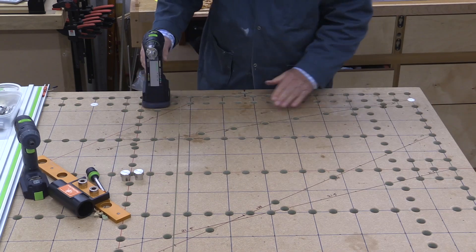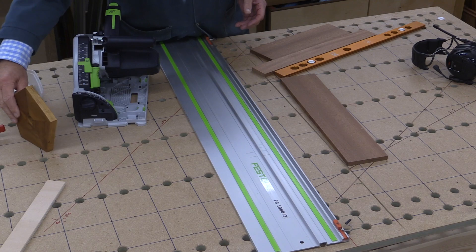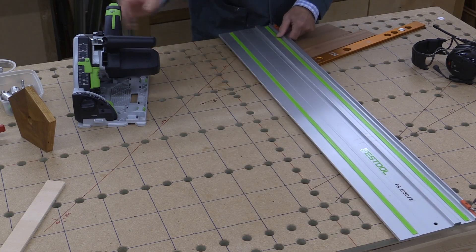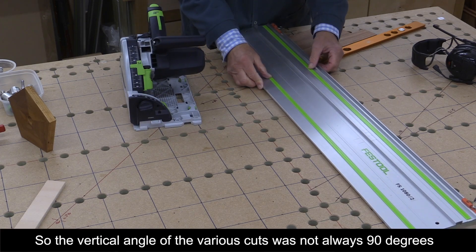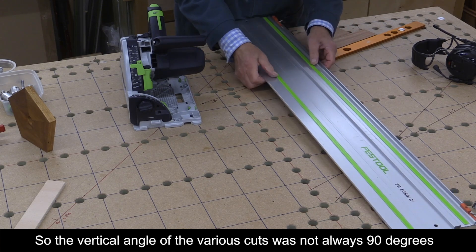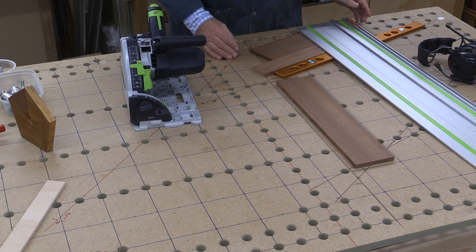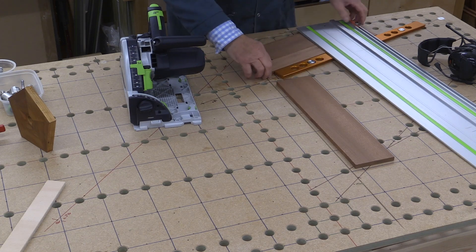There we go, that's all set up. When I set this up for the pentagon, I wasn't aware that there would be an issue with the saw sitting on the track. My problem was that the saw was sitting on the track but the track was able to move. That's partly due to me putting pressure on it, but it was because the track wasn't fully supported underneath. So this time, when I have a go at this much more ambitious ten-sided polygon, I'm going to make sure I'm supporting the track as well as I can.